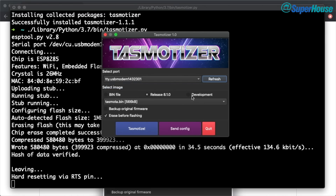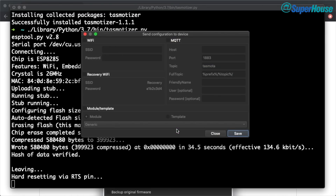At this point, you would normally have to do the Wi-Fi dance where you connect to the device and reconfigure it. But this is where the real killer feature of Tasmotizer comes in, because what we can do is configure it through the GUI using the USB connection — you don't have to do that Wi-Fi dance. We'll just refresh once again, select the serial port, and click on Send Config. It shows us different configuration options we can send to the device directly from Tasmotizer. To edit them, you have to enable the section. So I'll enable Wi-Fi and now I can give it the name of my Wi-Fi network and type in the password.